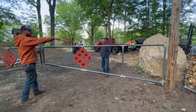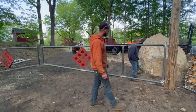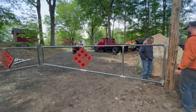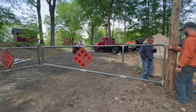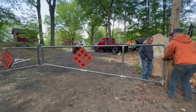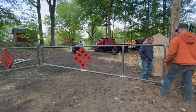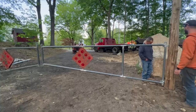And also, definitely, mind you, look at the J-hooks. The way that they're facing. I see you. I watched a couple videos last night. I see you. I guess it's the same. It looked like maybe it'd be harder to measure it even. It's the same thing, and all I did was put the bottom one on first, and then I came with the tractor over there and slowly lifted it up until this was sliding, until I could get this on. Then held it in place and hit it with the power ratchet. But I was surprised at how easy it was.